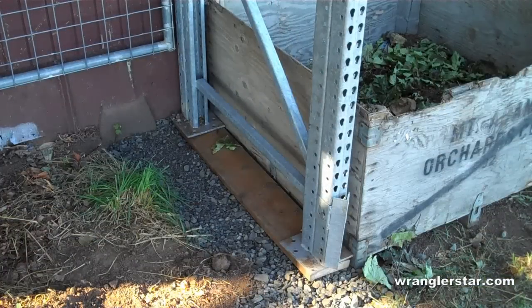Here I've got the first leg of the tower set up. All I've done is put about six inches of compacted gravel in there, and then I've got an old piece of pressure-treated two-by-eight. Pressure-treated means wood that will not rot away — it's treated with a chemical. If you ever have to put something on the ground, a bottom plate, anything that's going to come in contact with earth or moisture, pressure treated is what you want to use. Having the gravel underneath is a double benefit because it helps to drain water away.